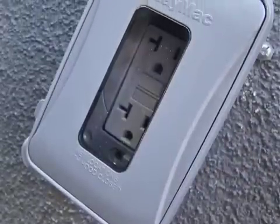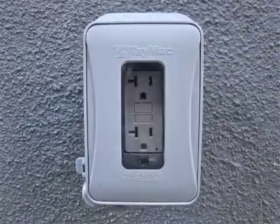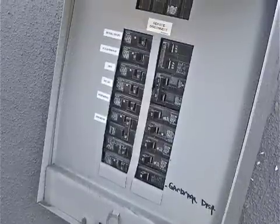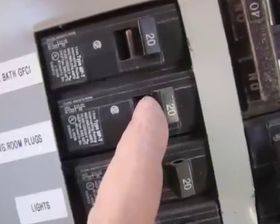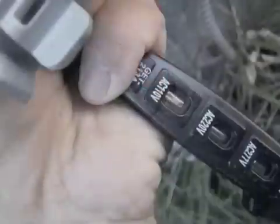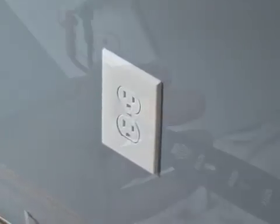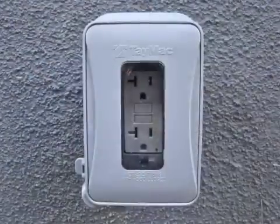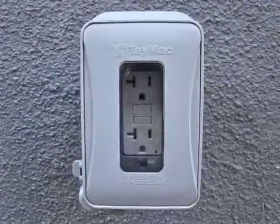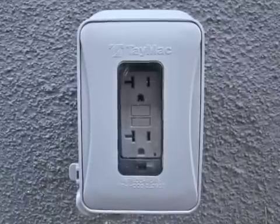That's all there is to it — this is one way to install an outdoor receptacle. But I'm not done yet. I've got to go back to the breaker box and turn the breaker back on to check that everything's working. I'll test the outdoor GFCI receptacle first — yes, I have power there. So I'll go back to the bedroom and test the receptacle there — and yes, I've got power there too. That's all there is to it. This is simply another free service tutorial provided to you by Roundel. Thanks for watching.